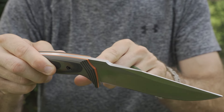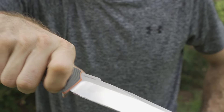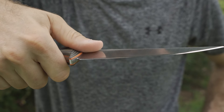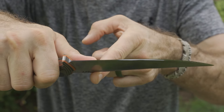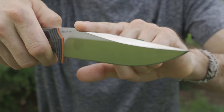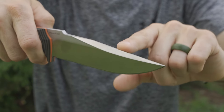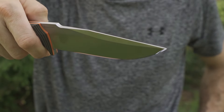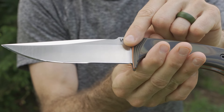There are strategically placed scallops right on the handle scale, and I do like thumb scallops whenever possible — I personally design that way as well. It aids in alternate grips, the ability to pinch the knife, get up close, but also when you rock the knife to the side you gain a ton of control with your thumb for scraping tasks. It's actually squared not only right through this section but all the way down that unsharpened swedge, so that should work very well for scraping tasks.